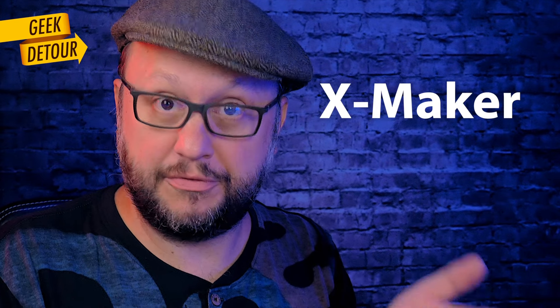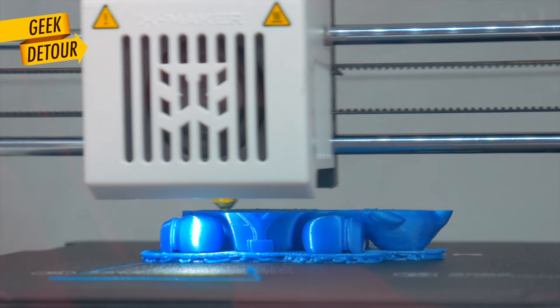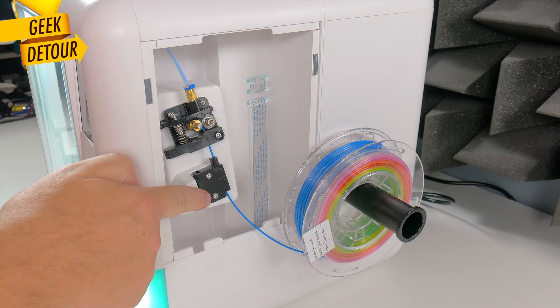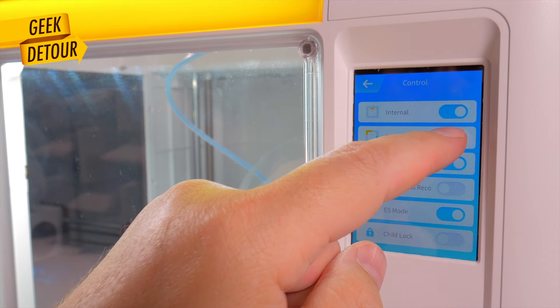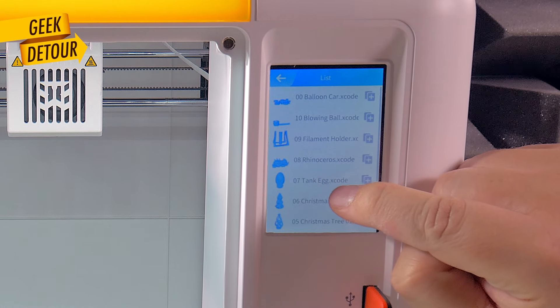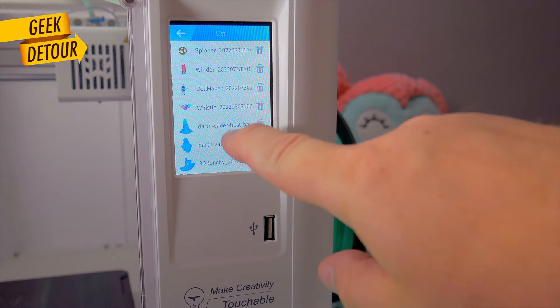The X-Maker is a 3D printer. It has a metal structure — it's quite heavy, actually. NEMA 17 stepper motors, particle fan, magnetic surface on a heated bed, dual-Z axis, filament run-out sensor, Wi-Fi, and a USB port for flash drives — I hate micro SD cards. The touch screen is capacitive, just like a phone, in color of course, and shows what you are going to print. It also has internal storage, so it doesn't matter if you print from a USB stick or from the computer or tablet using Wi-Fi — the printer always keeps the file, making it very easy to pick something to print again, just from the printer itself.